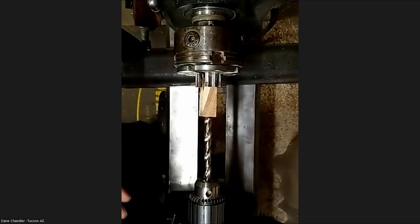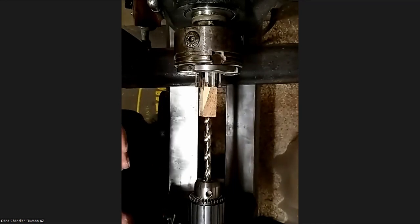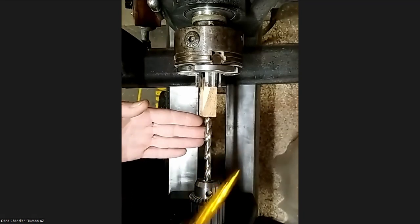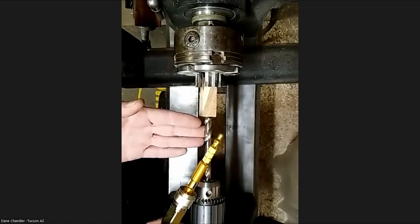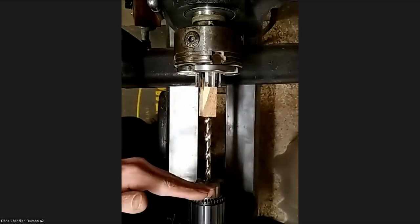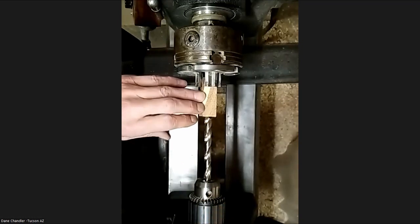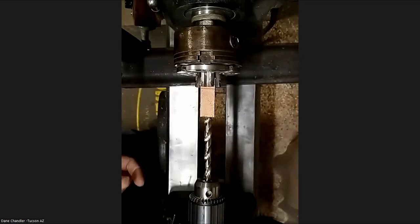I find between 300 and 400 RPM to be the optimum range of drilling speeds. It prevents the heat transfer created during the drilling operation. The air prevents the heat even taking place. And being at that speed, if you're just going in and back out, clearing the chips and taking your time drilling the hole, especially on acrylics, that will prevent heat stress fractures being created in the acrylic blank. Does that make sense to everyone?